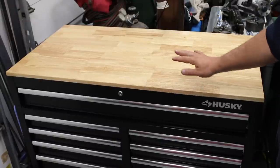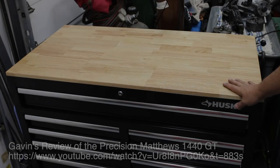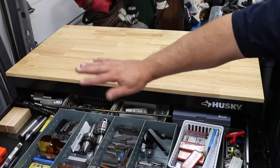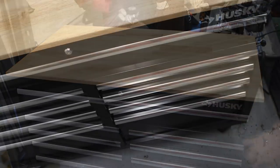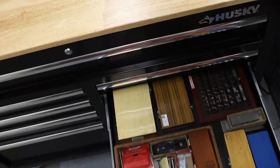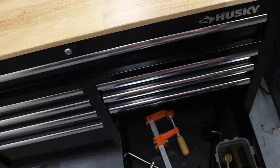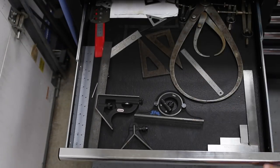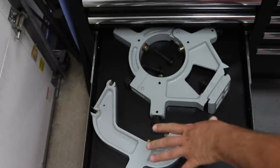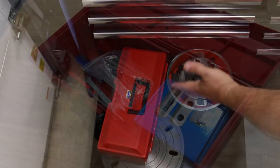This rolling cart is a page right out of the book of Gavin from Ultimate Reloader — I saw his video and bought the same cart from Home Depot. I have all my turning tools, tailstock accessories, cutting bits, and chucks up here. Other drawers hold metrology equipment: micrometers, calipers, gauge blocks, indicators. The lower drawer keeps my three-jaw chuck when not in use. On the other side there's more measuring equipment, squares, deburring tools, and the follower rest and steady rest. The bottom holds the faceplate, four-jaw chuck, and the toolbox that came with the lathe.